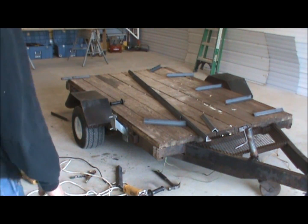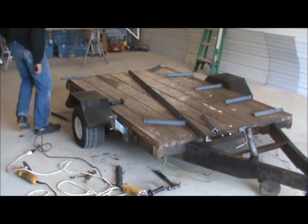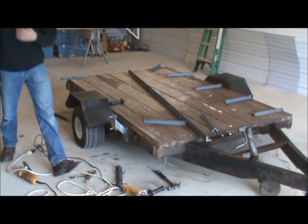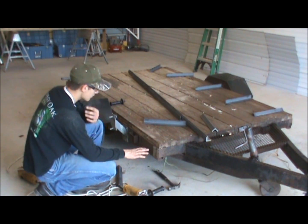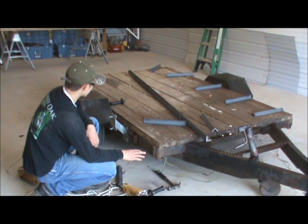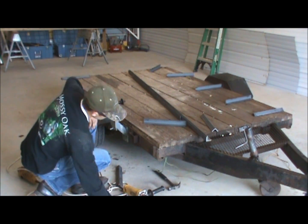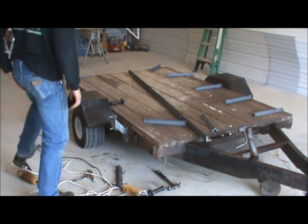Alright guys, what I'm doing now — I had to cut a couple little pieces off in here, just stuff that's going to be in my way. I'm just going around and getting this all cleaned off. I got the grinder out, grinding some of this rust. This is the worst thing about working on all this stuff — it's rusty. I still haven't quite decided yet if I'm going to use the stick welder or the MIG. I'm starting to think stick might be the way to go just because there's rust and it handles it a lot better.